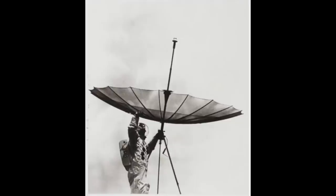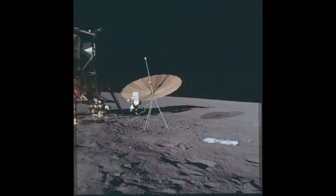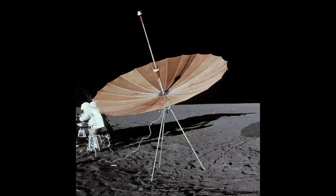But even that was still insufficient for the LEM's smaller antenna. However, the engineers calculated that if you equipped the astronauts with a larger foldable antenna that they could deploy on the moon's surface, color TV would be possible in conjunction with Goldstone or Parkes on the ground. And that's exactly what they did for Apollo 12 — the large deployable high gain antenna is quite big compared to the size of the astronauts. There was still no good solution around the limited bandwidth problem, so they just low-pass filtered the signal to 700 kHz, considerably reducing the amount of detail. It started all good until Alan Bean relocated the camera on his tripod as instructed, but then had artistic inspiration and decided to get a shot with the Earth in the background — except that the sun was within 5 degrees of Earth.